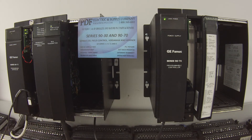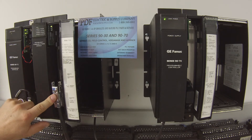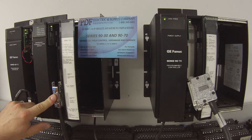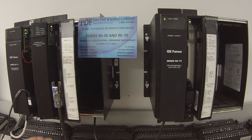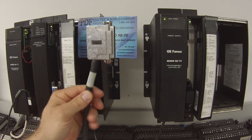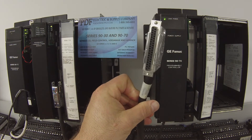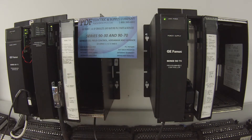I have a cable here connected to the expansion port on the BEM713. I'm going to be switching this cable between the RCM711 and the BEM711 to see if there's port activity and they can all see each other and talk. I can tell that through the LEDs. The part number for this cable is IC660WD005. There's a male and female end to this cable — it's about a 37-pin connector. You'll have to have that in order to do the test.